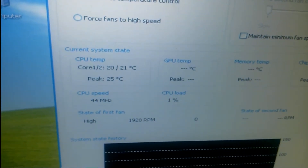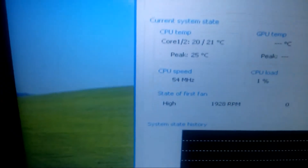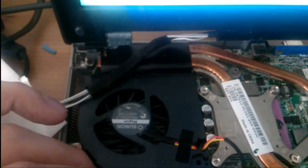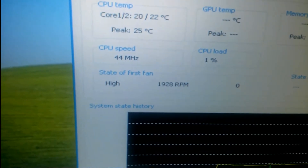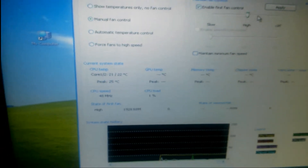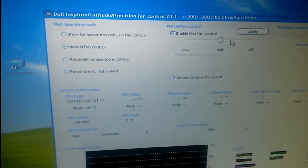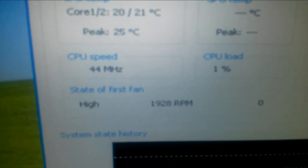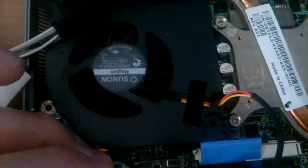I have no way to fix the laptop at the moment. The GPIO pin is damaged at the MEC5025, and the chip costs too much — about 18 euros. Do you think there is a way to control the fan without using the feedback? The laptop can read the sensor readings; the temperature readings are available inside the computer using the EMC4001. Could we write code to control the EMC4001 and put 5 volts on the rail to run the fan? I don't know — I need to investigate more. That is what I could find during the last period; I have to investigate and troubleshoot further.